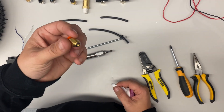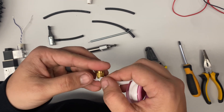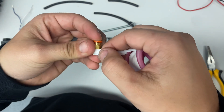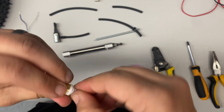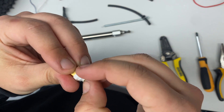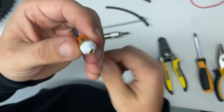A quick tip on the smaller fitting: it's going to be a much smaller thread, but if you apply the tape on the backside, it'll do the same job and you won't have overlap over the hole itself. Just a small amount there, and any excess you can scrape away with your finger to keep that hole clear.